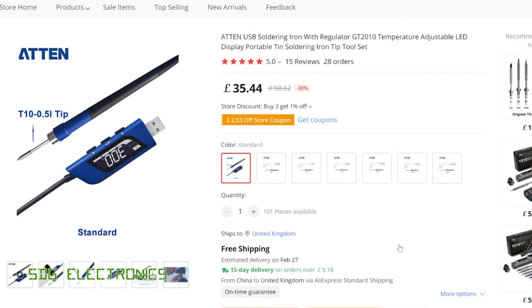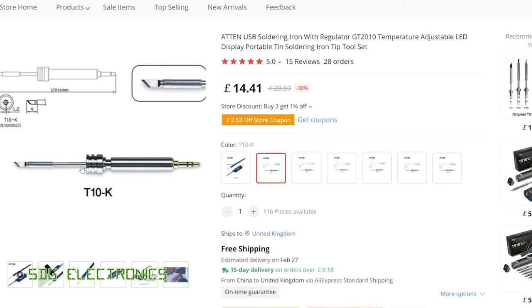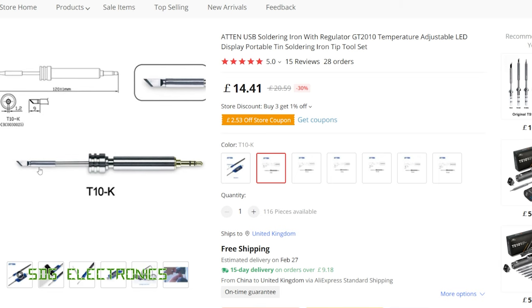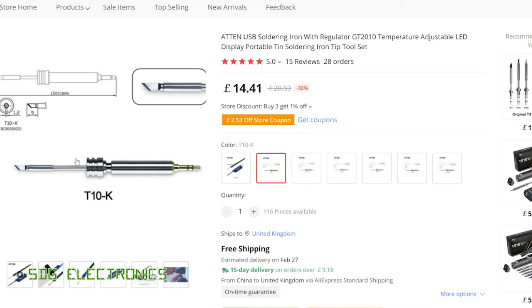This one is coming in a little bit cheaper than most of the soldering irons we've looked at - £35 delivered - but quite a substantial amount of that cost is actually the cartridges. They've got Weller-type cartridges with a 3.5mm jack at one end, then a beefy assembly, and then the cartridge at the very end where the soldering tip is. This can quickly add up in cost, and these cartridges are only about £5 cheaper than most of the Metcal and JBC cartridges, so really quite expensive.